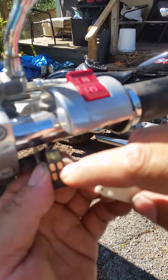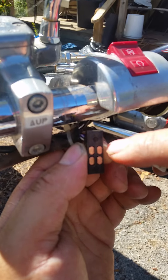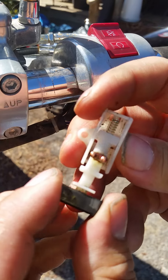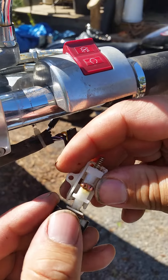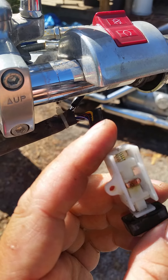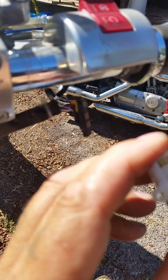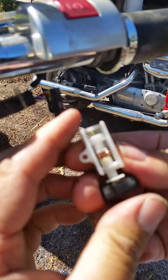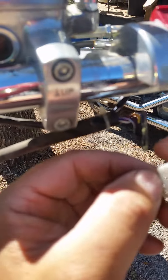I cleaned this up — I just took a little bit of sandpaper and scraped on there a little bit. I didn't want to scrape it too much because it does have to make contact. I took it apart like I showed y'all earlier and I cleaned the two contactors right there and cleaned up the spring. It looked like it had some type of electrical oil in it, maybe to keep it from corroding. Since I don't have any, I'm gonna spray a little bit of WD-40 on here just to disperse the water that gets in there from sitting out in the weather. They've got four prongs, two on each side.